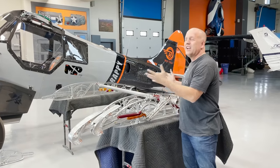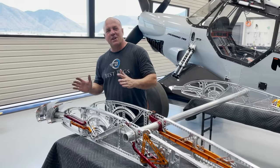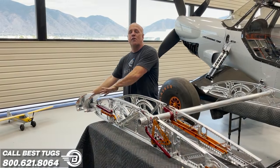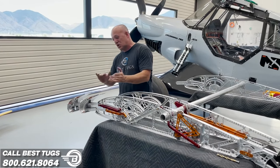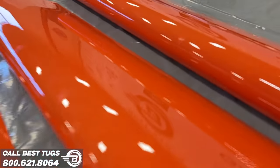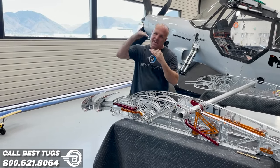The idea here is, let's see if we can advance aviation and try something new. And maybe someday this idea can roll into another, maybe these will make it into aircraft. So what's happening now, as these double slotted hyper slats move forward, and by the way, they look like slats, I actually changed the shape a bit to improve the blending of the two, but they're actually huge. And I had to do two because as it comes back and they pair up, they make a really flat chord line. And if I tried to do it with one, it made a kink in the wing.